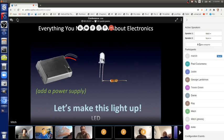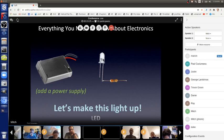And this is to answer your question now, at least in part, for this particular circuit. To make an LED light up, where do we put the black wire? Well, you have a 50-50 chance here. The black wire can go to one of two places: either the short minus wire, or the right side of the resistor, which is in series with the long positive wire. Anyone want to take a guess?